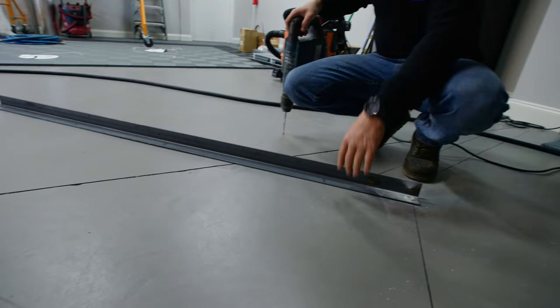Shackle gets threaded through. If you don't use a shackle, what'll happen is as it squeezes, it might try to bend over the bolt or bend the eye bolt, so using a shackle gives it a point to pivot.